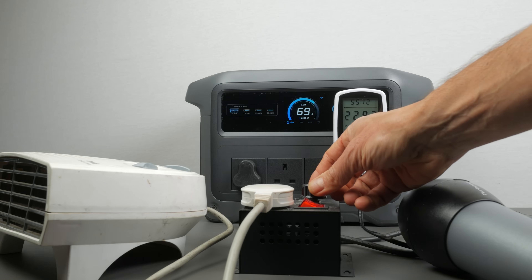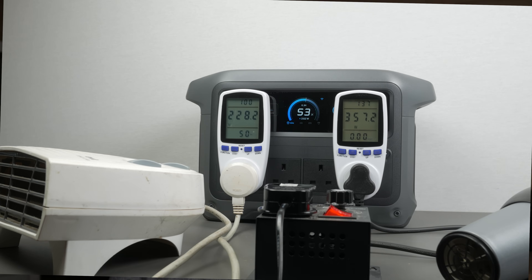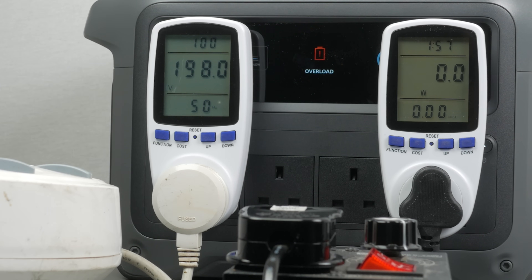There is one feature I'm not so keen on. If you plug in a device that exceeds 2000W but stays under 2400W, the power station will use its surge pad technology to keep it running by lowering the voltage, so the actual output power still can't exceed 2000W. EcoFlow and Bluetti also have this feature but they let you disable it in their apps. Unfortunately, just like on the Anker Powerhouse 757, Anker doesn't give you that option. It's fine for resistive loads like heaters, but I'd be cautious with sensitive electronics, especially if you're already close to 2000W across the other sockets. Trying to deliberately overload the unit, eventually I get an overload error and the AC shuts off. You can turn AC back on after around 30 seconds.